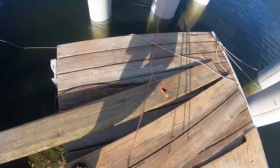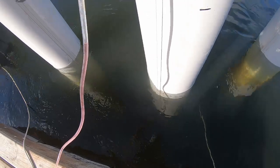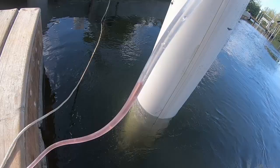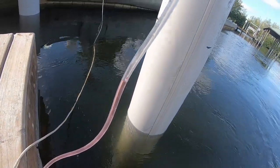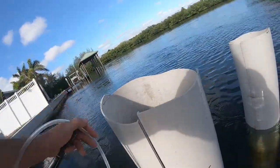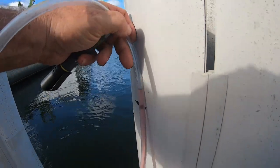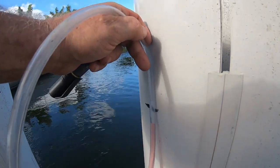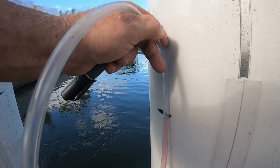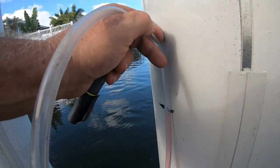And you can see the pink inside. And wherever this tube happens to be, the water in there will be at the same level as your jug, no matter where you go with it. So if you hold that up against your pilings and wait for that water to come back, it's sloshing back and forth a little bit before it settles out, but there's the height of your water, the height that you've assigned over there with the jug.